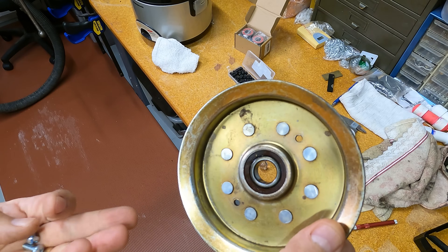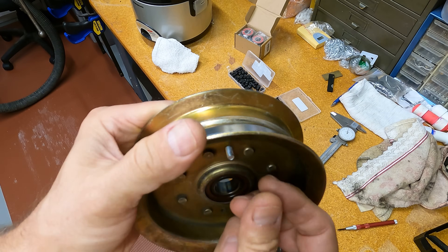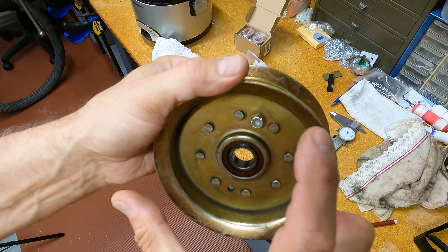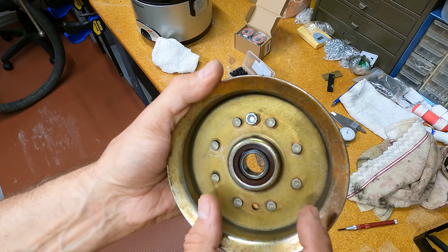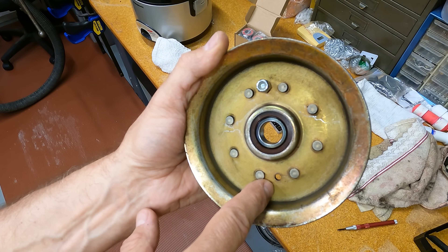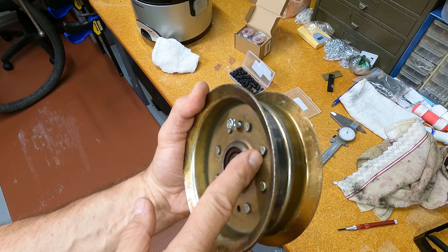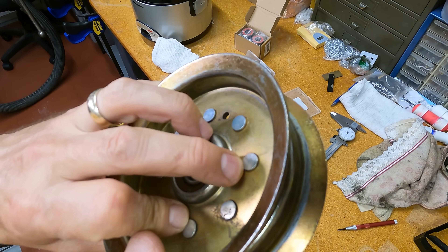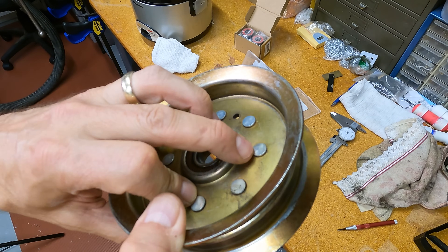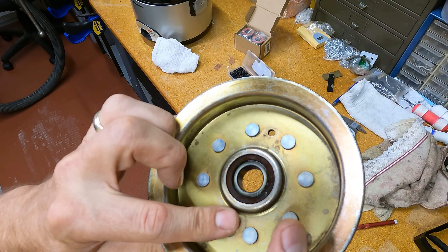We're going to use these holes for the reverse purpose — put a screw through each one and a nut on the back on both sides. That's so that as I drill these out on the drill press, towards the end there's going to be a likelihood for this thing to shift around, and we don't want that. So I'll reuse these holes the manufacturer used to put it together, to help take it apart and hold it together until all the drilling is done. The rivets have a fat side on one side and a larger-diameter, flattened, much thinner side on the other. We're going to drill through the thinner side — that'll be easier. So we're going to set up a quarter-inch drill, put these bolts in place, and get over to the drill press.